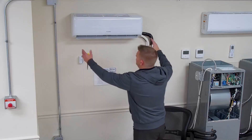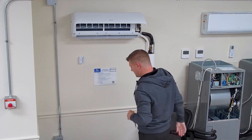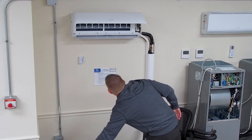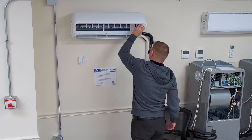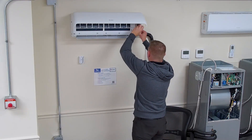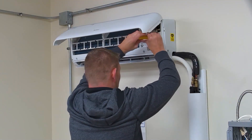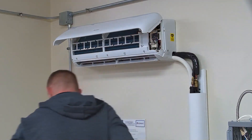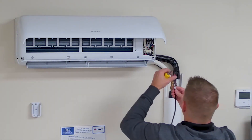What we're going to do first is lift this cover up. Generally you'd have to take this cover off right here — I already took that cover off. Power is off. What we're going to do is disconnect number 2 from the outdoor unit here, and we're going to hook up all three connections to the indoor. Again, they're labeled 1, 2, and 3, just like the outdoor. So you hook up 1 to 1, 2 to 2, and 3 to 3.